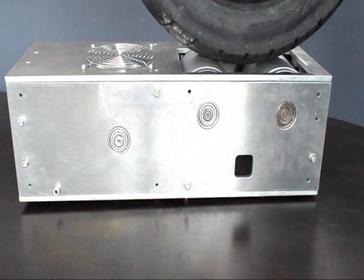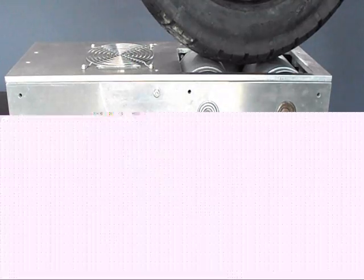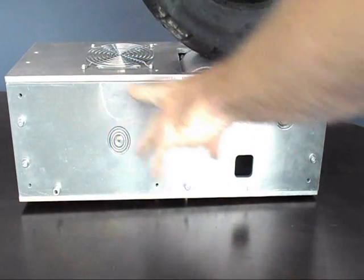This is the Focus Applied Technology hyper mileage chassis dynamometer, designed especially for university competitions like the Shell Eco Marathon, electric motorcycles and bicycles, as well as conventional motorcycles. It weighs about 18 kilos and can absorb up to about six kilowatts of power. The driven wheel sits between two rollers, the rear driving an internal eddy current dynamometer.